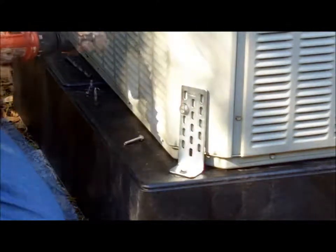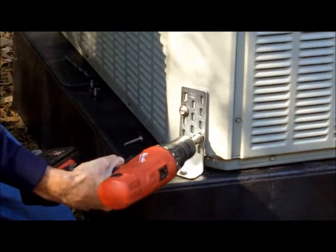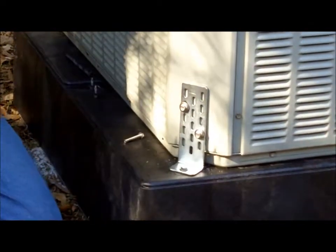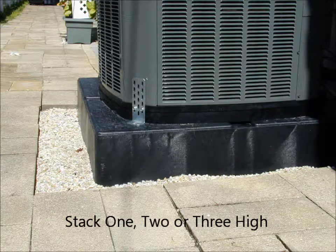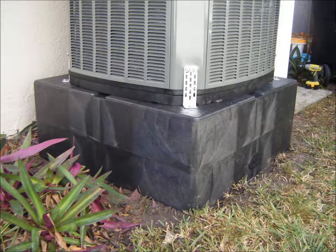The condensing unit is attached in a conventional manner by using the stainless steel tech screws. Repeat this process for all 4 brackets. A typical installation can be done with one man and only a little help needed to place the condenser on the pad. Each pad weighs only 45 pounds, which reduces work-related injuries.